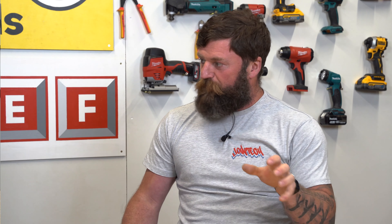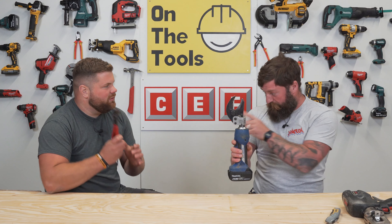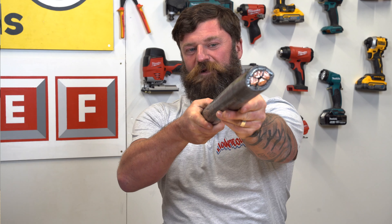It's intriguing — and I want to have a go. We've all got a Stanley knife in our pockets, we don't need to explain them. The next tool is the exhaust cutter — not designed for my job, looks like some sort of torture device. It's designed for mechanics, to cut exhaust. But I use it to cut the steel wire armoring on cables to allow me to get them into panels, switchboards, and whatever else. It's incredible how much time it saves — versus a hacksaw, where you'd have to saw like this. With this you just loop it round and roll. It goes through it — incredible.